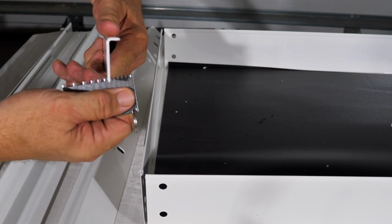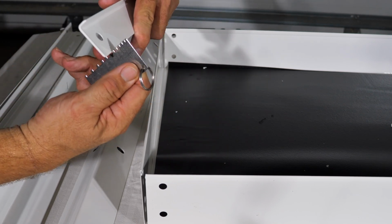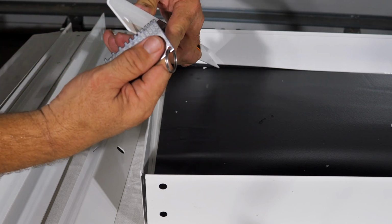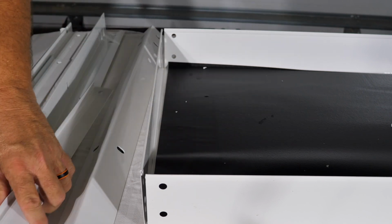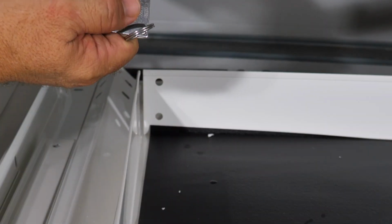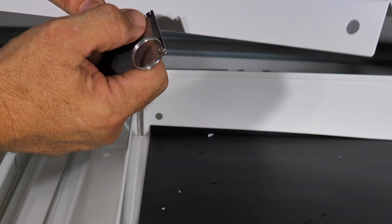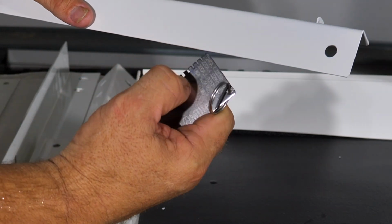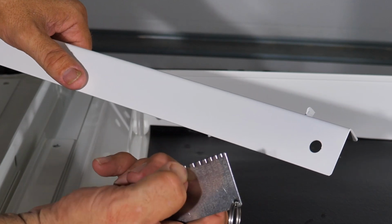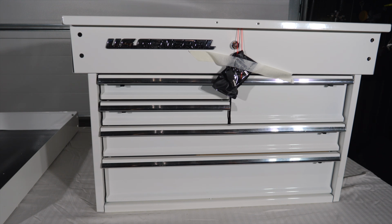These additional pieces here, probably the same. Yeah, so it's not fitting on the 14 either. Again, due to the powder coating, so that could be 14 gauge metal. I believe we might have 14 gauge on these legs and 16 gauge on the tray. And as you know, with metal, the smaller the number, the thicker the size. So 24 gauge is really thin and 16 gauge is much thicker, and 10 gauge is basically a little bigger than 1/8 inch.